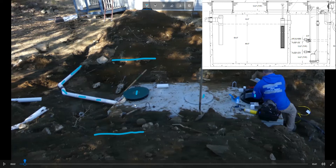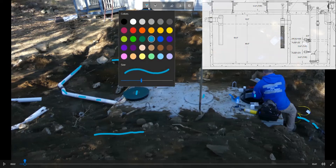The baffle allows solids to come in from the house, hit a sanitary tee inside the tank, and then settle out. There's a baffle that the effluent is able to pass over, and then we've got a high-head pump that's going to push out to the drain field. You'll notice we've got a small, what looks to be inch-and-a-quarter line on the discharge.